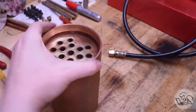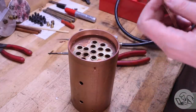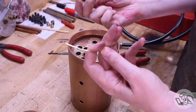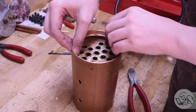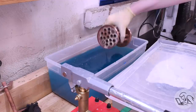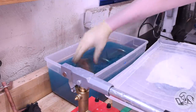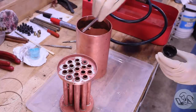Next I prepared my silver solder, making large rings and opening them up a little bit. I want them to be a little larger than the shell in diameter so that they're held in by spring tension. Now very importantly, this is a lower temperature silver solder than what I used on the tubes. That's the whole strategy here, so that I can silver solder those without risking damage to those tube joints. Now I'm going to pickle these two components. Ostensibly I don't need to do that because they've both been mechanically thoroughly cleaned, but for the five minutes it takes to pickle, might as well.